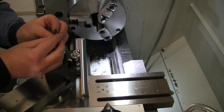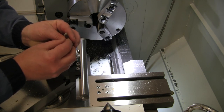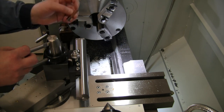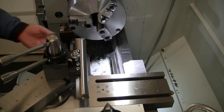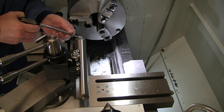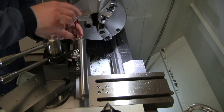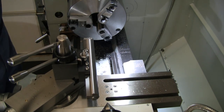We've got a nicely sharpened tool bit. These made-in-the-USA carbides — this is a very nice looking tool bit compared to some of those big 3/4 inch ones. We'll get that in there and put just a little bit of oil on our threads since I just air-blew them. There we have it — there is our boring bar built.